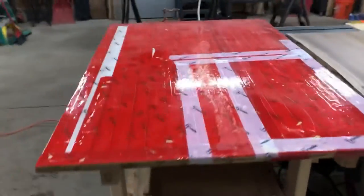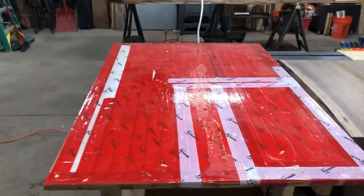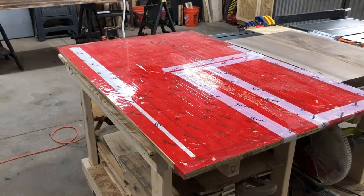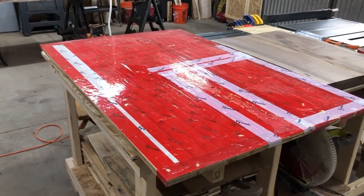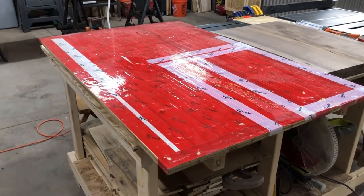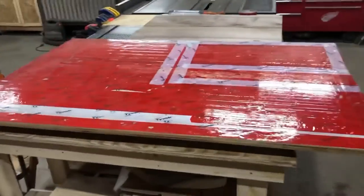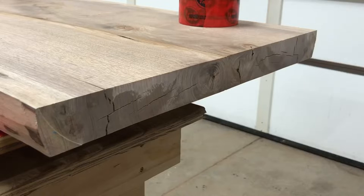This is just a piece of three-quarter inch plywood covered completely in house wrap tape — Tyvek tape, tuck tape, whatever you've got. It's real handy because epoxy and wood glue won't stick to it, so it's a great working surface for adhesives. Not everybody has the space or need for this, but it's definitely helped me. It's not a one-time use thing — you just touch it up as you need to. Before you tape anything up, make sure everything's vacuumed off; having it sanded to around 80 grit helps the tape stick better.